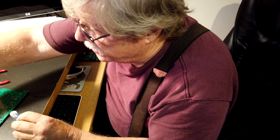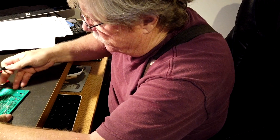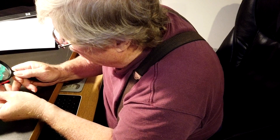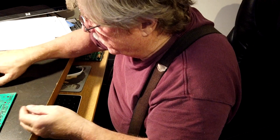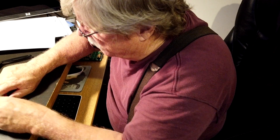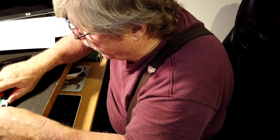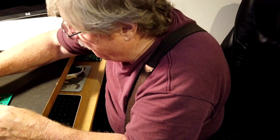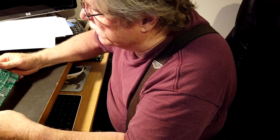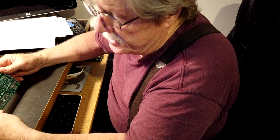When you're satisfied, I always take the magnifying glass and look to make sure that I've got a good solder connection. It looks good. Take your wire cutters and snip them off — I'd leave about a sixteenth of an inch standing up. That's how you put the parts on there.